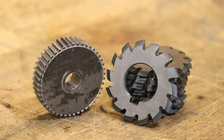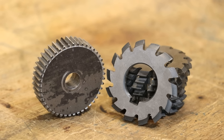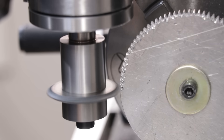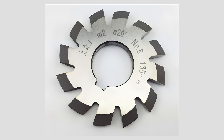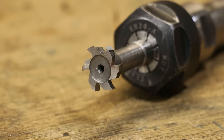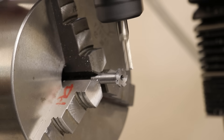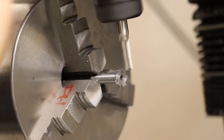My original approach was going to be to copy these involute profile cutters, which I used to make the gears. The side profile is machined to match the gear tooth shape, with relief cut in to prevent rubbing and a cutting edge cut in so that it can cut. A big advantage of copying this is that I already have a tool holder which can work with it. However, whilst making this may seem simple initially, being able to create the relief is not so straightforward. The cutter is not a true circle — the area behind the teeth has been ground away so that it curves down and forms a true relief. If the profile were more squared, like a T-slot cutter, we could easily remove the back material to form relief. But because the profile isn't square, that method won't work as well.